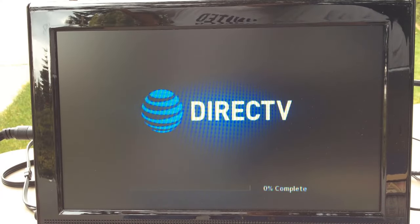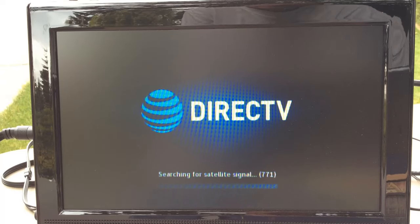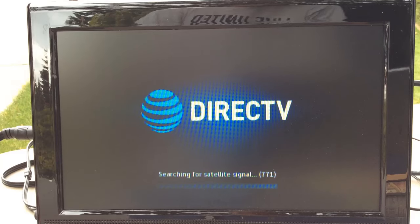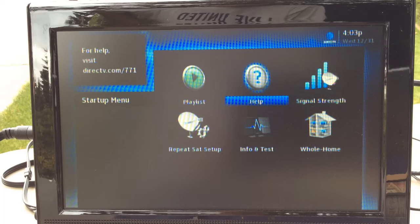It's been about 3 minutes. The nice thing with the SWiM single wire multi-switch LNBs is the receiver should automatically discover the dish type, and of course it's searching for a signal because we haven't aimed the dish yet. So if I press menu on the remote, we can get into the satellite setup screen. So we're going to go to signal strength.